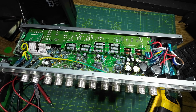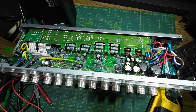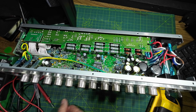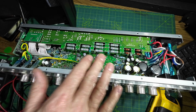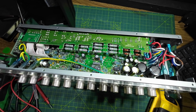So I'm going to go off now and see what info I can find out about this, and how this circuitry works, basically, because we've got no idea. We've got no schematic. I don't know whether it's cathode bias or fixed bias. Can't see any bias resistors. Can see the screen resistors. I know they're screen resistors, I've measured them, they're 1K. I've got an array of resistors on here, but I presume, and again I'm speculating, that these are to do with the power soak part. The first size resistors, the 5 watters, are all of a fairly low value. I could be wrong. I don't know, and we'd have to be testing. So I'm going to go off and see what I can find out.